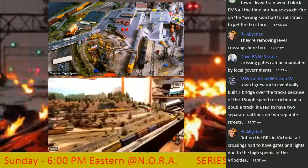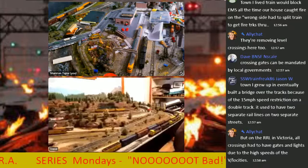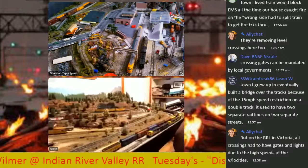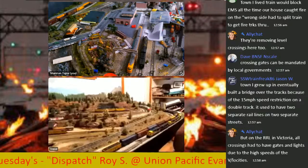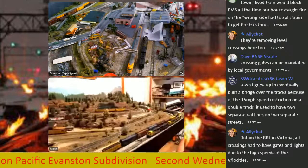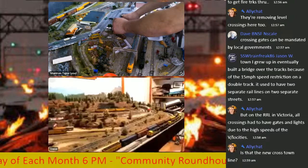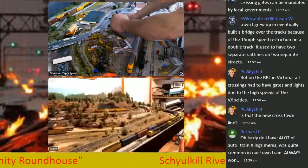Technology is a double-edged sword. It's good and it's bad. This DPU stuff now, the technology is so rock solid and dependable because of the satellites. When I was running, they had something called RCE, remote control equipment, for unmanned helpers. It was a radio signal, and it was unreliable at best. If you went through a tunnel or a big cut, the mid-train helpers lost continuity with the head end for whatever reason.